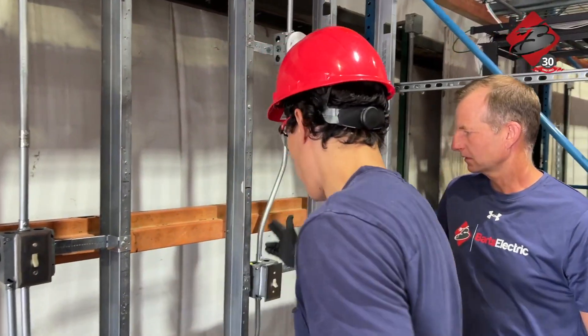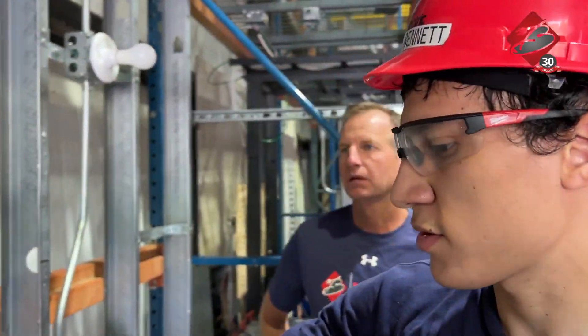I just did the hot neutral ground through here and then just switched it to a switch leg neutral ground. Now I'm not running excess wire to spots that don't need it.